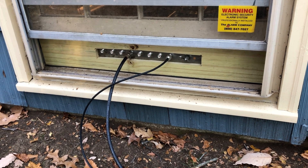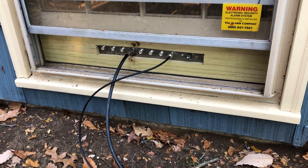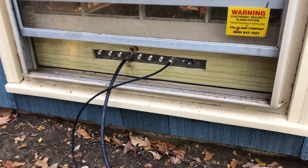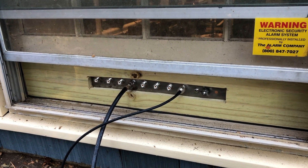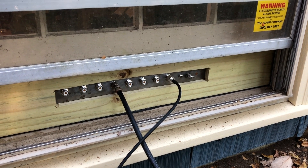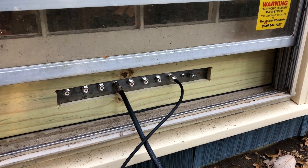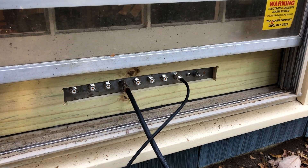Today's project was to complete the window antenna demarc panel project. On the panel are eight SO-239 feedthroughs. There's also some stainless steel hardware on the right side for ground — a wing nut facing outside and a wing nut facing inside. The wood is just simple pressure treated one-by that you can get at any home center. The metal is just some steel I got from the same home center, and I cut it down to size with a grinding tool with a cutoff wheel on it.